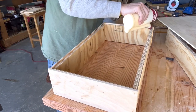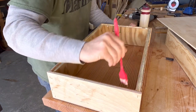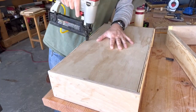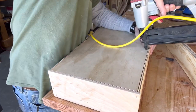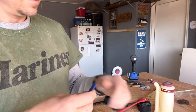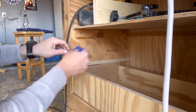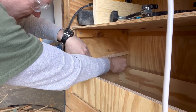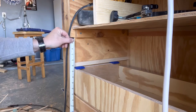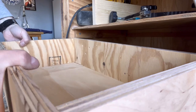Knowing the bottoms fit fine, I went ahead and added some glue — Titebond 2 again — and threw some brad nails in there, again just to hold it together while the glue dries so I can continue working. I link these shims in every one of my videos; they're so handy. They come in multiple thicknesses and you can break them apart. I'm using them here to space the bottom drawer from the top drawer slide so they're perfectly spaced.